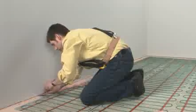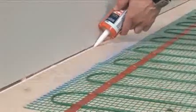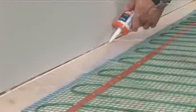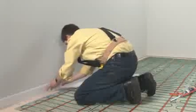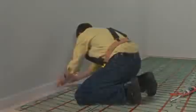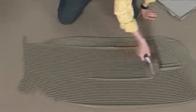The second technique uses polymer-based self-leveling underlayment. Prepare your floor before pouring the base layer. Fill any holes with fiberglass. Run a bead of silicone between the walls and the floor. Glue a foam sheet along the base of the wall. Apply a primer coat on the entire floor surface and let it dry as recommended by the manufacturer. With a scraper, carefully spread the self-leveling underlayment. When it is completely dry, install your floor covering following the manufacturer's directions.